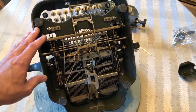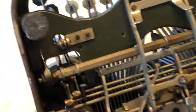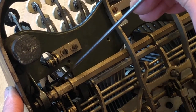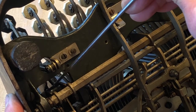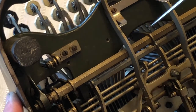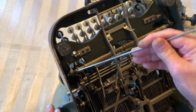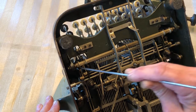There are some other things I'd like to cover here too. Right at the end of this here, there's a little barrel nut that the arms ride on. If those don't spin — you can see this one's free — I've had a couple of them that are rusted so they don't spin. There's one on each side. Make sure those are free. And then the pivot for this bar is here and here — make sure that's oiled and free.